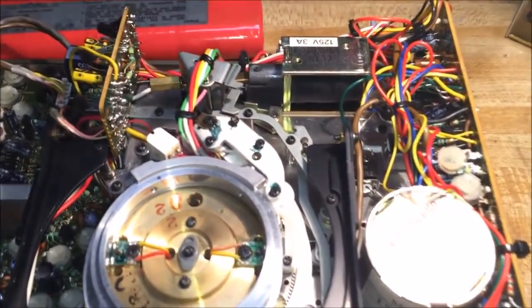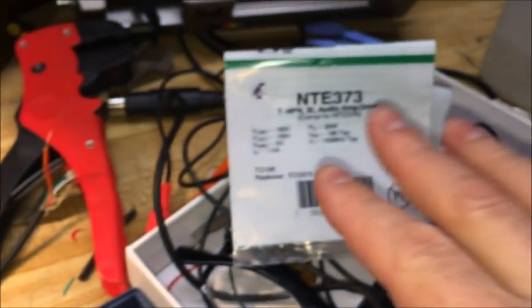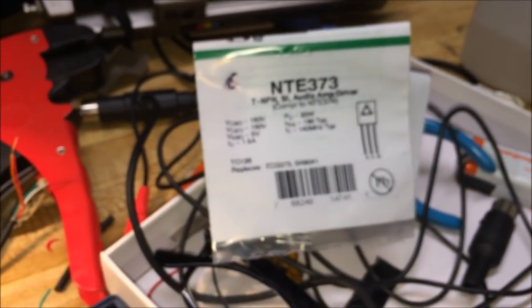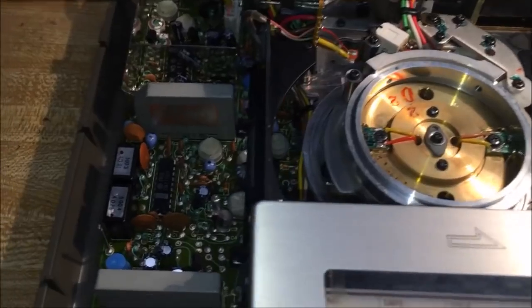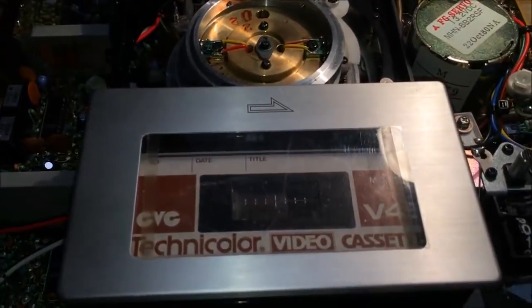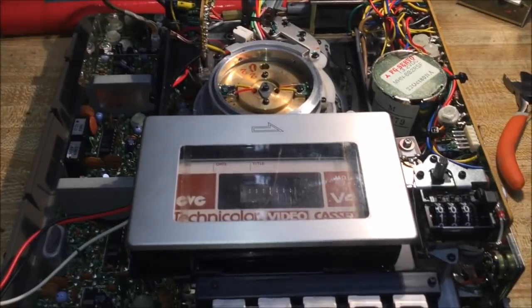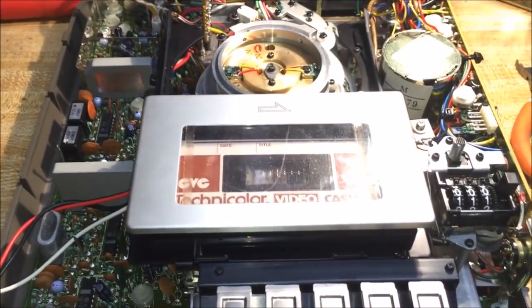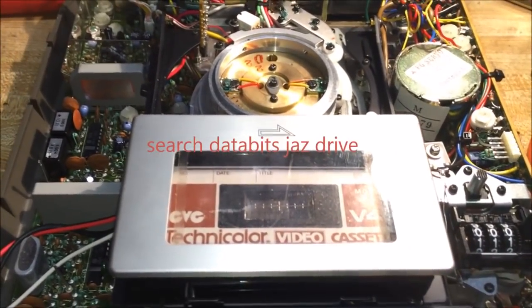So what's the next step? The next step is to replace those two transistors, as I mentioned earlier — you can see one of them there once again. So I'm going to replace those with the new ones and we will see if it works better as a result. That's what we'll show you in our next segment. If everything works like it's supposed to, we'll have something cool to show you, and then I can show you the footage that's on one of the CVC tapes I acquired. There's another video I made where I talked about rare formats and showed one of those CVC tapes.